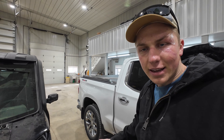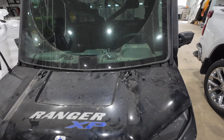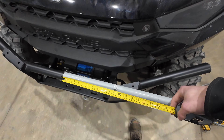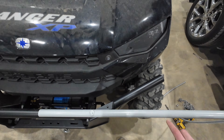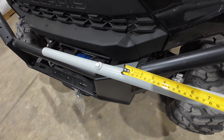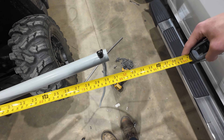The way our Ranger is set up, we've got the GPS globe right there in the middle, and my first row of corn seed is going to be 15 inches off of that center line. Because there's a weight bracket that is 30 inches wide at the end, I needed to add another 30 inches to this post. That way when we create our boundaries, we don't hit any fence lines in the fields with the planter. If that little chain out there hits anything in the field, that means the planter is going to hit it — so as long as we stay that far away, all of our boundaries should be dialed in.